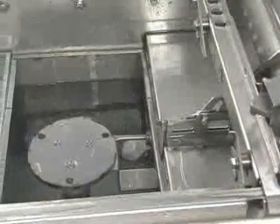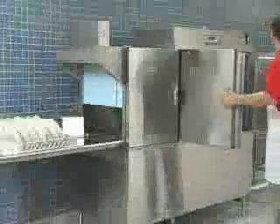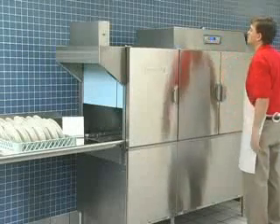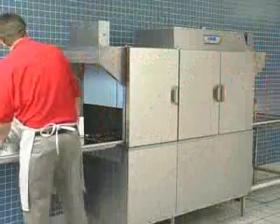When the drain lever at the front of each tank is lifted, the standpipe is raised, draining the tank. The auto-positioned rinse arms will consistently be properly seated, providing a consistent sanitizing rinse pattern. Auto-fill will fill the machine automatically and maintain the proper water level after the door has been closed and the power turned on.